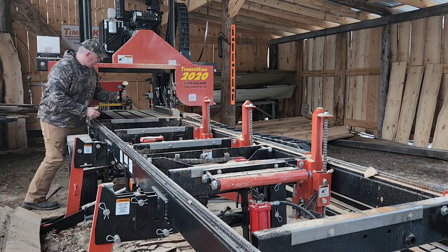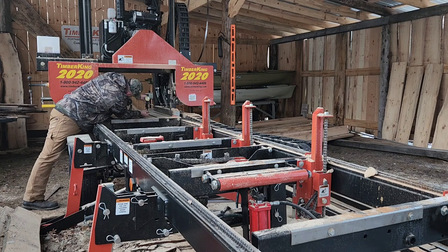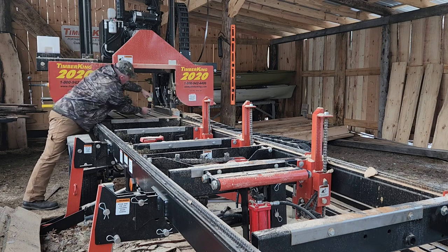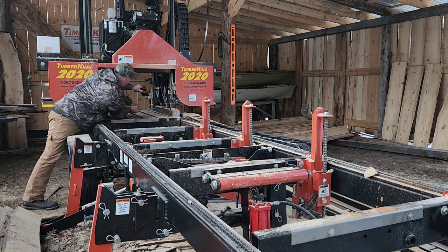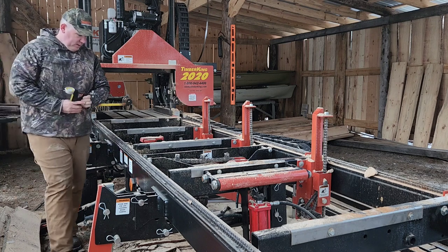See what she reads. Now I zeroed this blade out earlier. We've got tension on her. Yep, we're reading right now, right at 18 thousandths. Check the other side. And then the bottom side of the tooth is reading at just under 19 thousandths. So that's comparable to about the same time we took it off for the Ripper S blade.